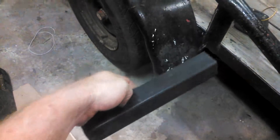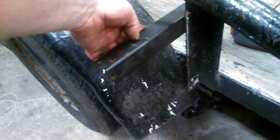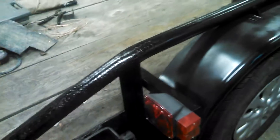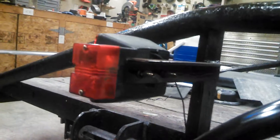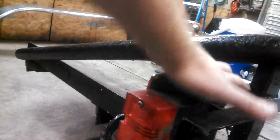What we're going to do is use some standard bed frame material — angle iron. I'm just going to weld it up basically like this, drill a couple holes in it, and mount the light straight to it. The whole trailer is in different stages so I can keep showing you different things, but this will be the finished product. Just that one bar going across, a couple bolts right to it, and weld it over. A little bit cleaner install, and it's plenty solid.